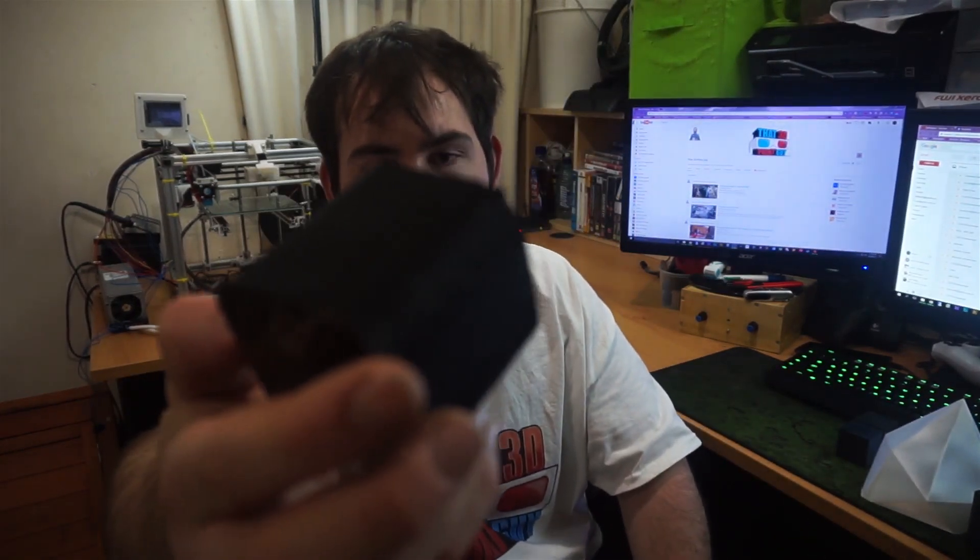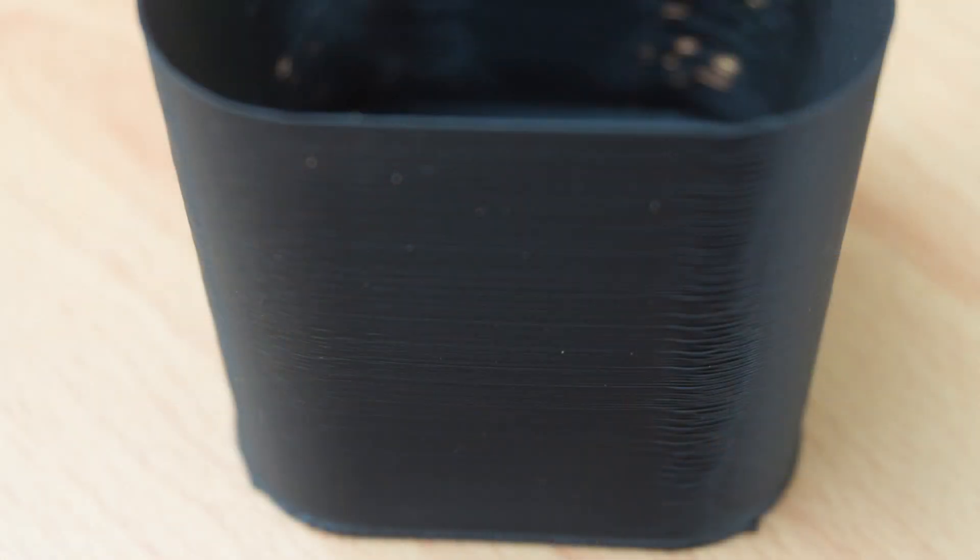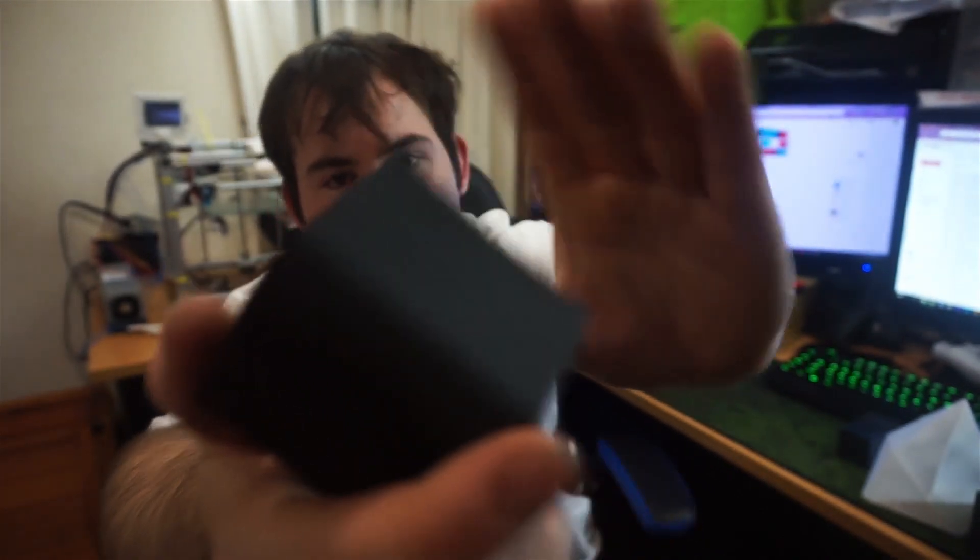Here's another little test. This was the same cube but printed with a couple of bottom layers — two or three — hollow inside and no top layers; pretty much printed in vase mode, since vase mode allows pretty much continuous speed printing. This was going really fast, going ham at printing this. You can just see the limitations of how fast this printer can actually print. This was printing at 300mm per second, and you can see all the bumps and holes in the corners where it slid down a bit — this is pretty much maxing it out. But some of the other parts, if you look, are like perfect — perfect sidewalls that are super smooth and really clean.